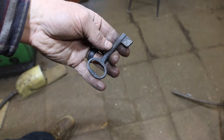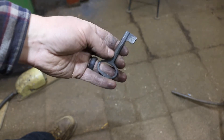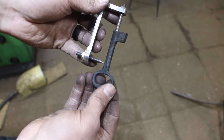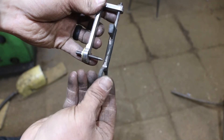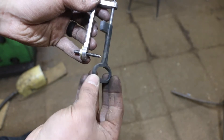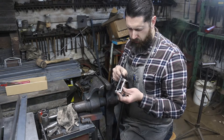The stem on this is about 5/16ths of an inch round and the bore hole is 3/16ths of an inch, so there's not a whole lot of room for that drill to not go pretty straight without coming out the side. Just from looking at it, it seems to go relatively straight. When we put it on the tool and begin to rotate it, you can see it gets a little closer there and further away on this side. That's what this tool does — it allows you to see where it might be out. It's ever so slightly off in one direction and I'm going to try to correct that as best I can.